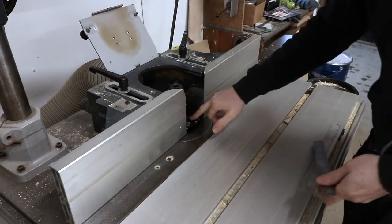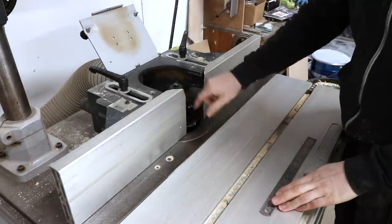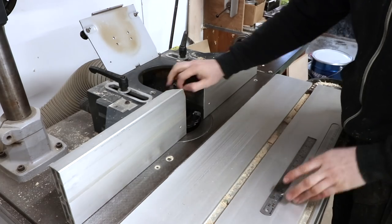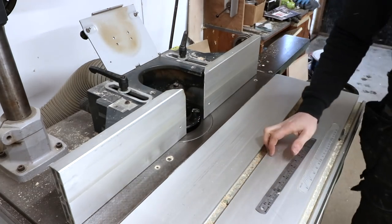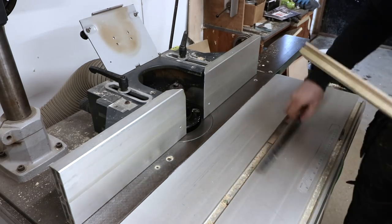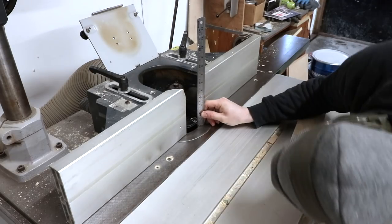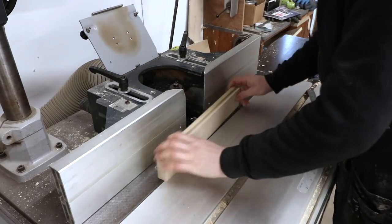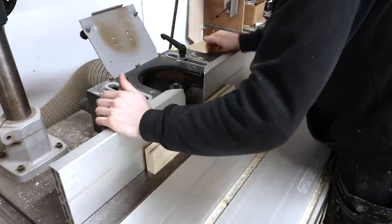Okay, so I've put my adjustable groover in the spindle moulder. I know how many spaces to put in this because I use the 9mm birch all the time, so put the appropriate spaces in to set the thickness of that. I'm going to set it to 12mm off the deck, and about 8mm depth of cut.